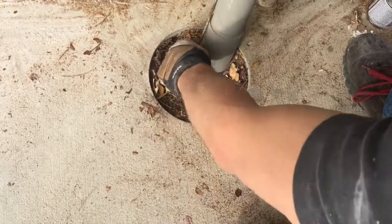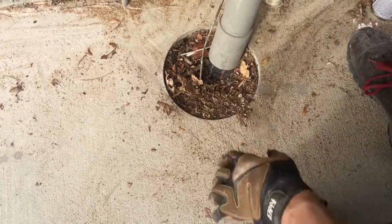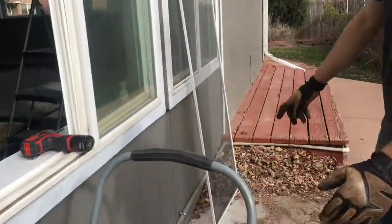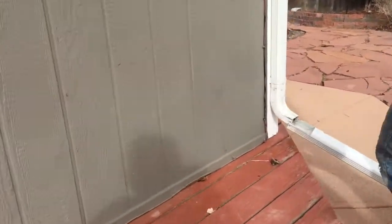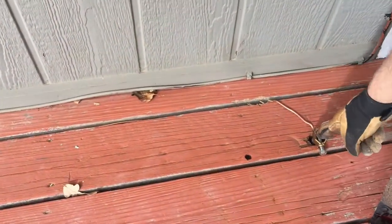This is the old ground rod right here. You cannot use it unless you can prove the acorn on the other side. On this one we actually had to prove it over here and drill through the sidewalk to ground it and make it continuous. We finally found in the deck where there was a piece of soft dirt in this area, so we drove it right here.